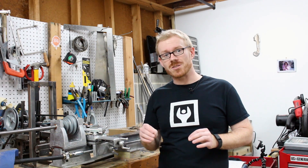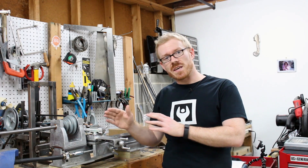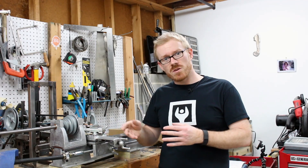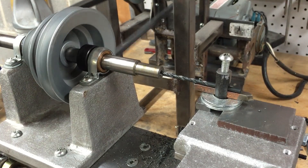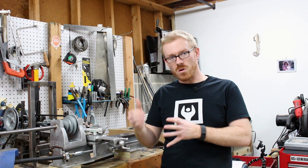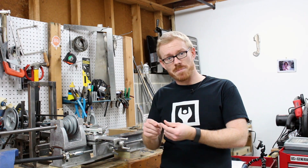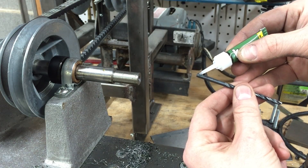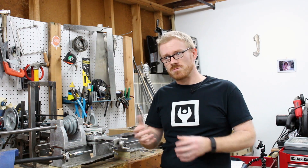The first step in the boring operation was preparation of the boring bar. I mounted a center drill in the tool post of the carriage and used the carriage with the center drill to bore a hole into the boring bar, then I used a twist drill to enlarge that hole. The purpose of the hole is two-fold: first it serves as a fixture for the drill bit that allows me to indicate on the headstock where that hole needs to be located, but it also serves as a hole that I can tap later to fixture the cutting bit for the boring operation. I just super glued the twist drill into the boring bar and that allowed me to drill a hole into the headstock.